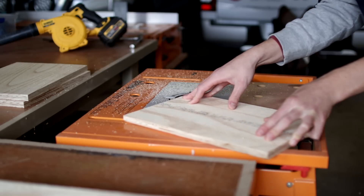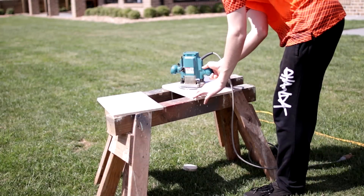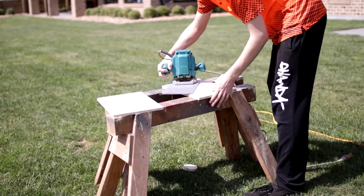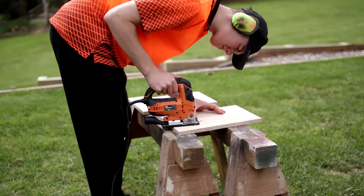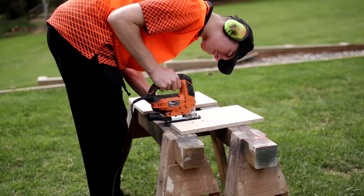This gives a very nice look to the finished speaker box. Once the round over had been added to the faces of the enclosures, I went out to the backyard with my Jasper circle jig and routed out the holes for the speakers themselves. I cut out the holes for the terminals in the back of the box with a simple jigsaw.